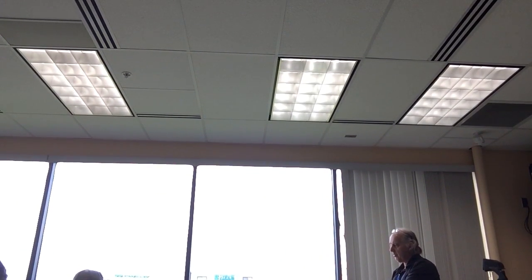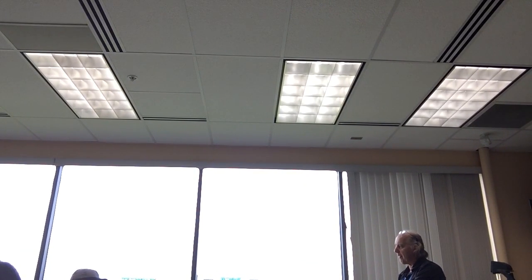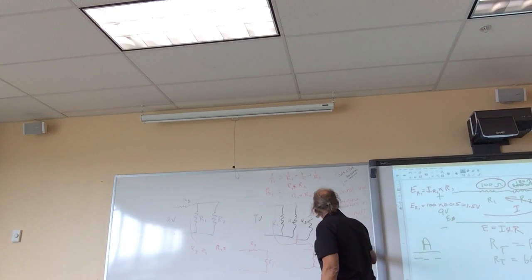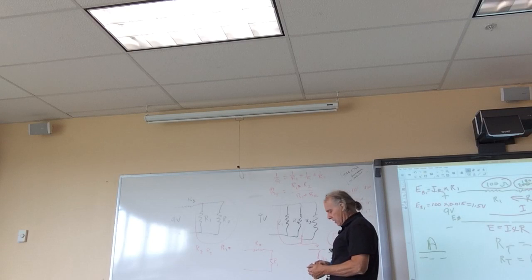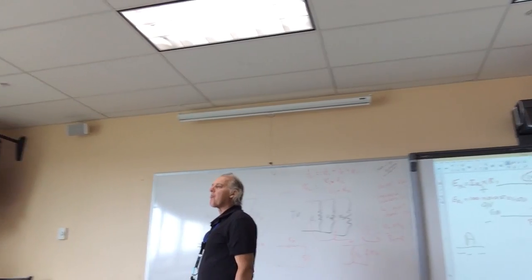Doesn't make sense? What's that? Different resistors. They're in parallel. So it's showing you the total resistance for all 3 of them. Gotcha. Figure it out. Do the calculations over there, Steve. Do the equivalent. And the RT1, this right here, should be the resistance that you see looking across all 3 of them. I bet you're going to be 52.7. I'll bet you it's real close to that when you calculate it out.